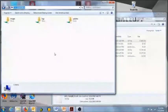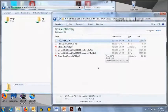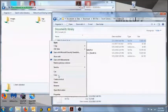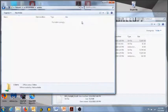If your BVS Smart Camera requires a firmware update, start by opening a file manager window and in the top address line type backslash backslash followed by the same name that was located after the HTTP login, containing the name of the camera. Once that's been typed in and you hit enter, you should see the camera's folders come up. Within these folders, you will notice a folder called 'update'. Go to the file folder where you copied the firmware from the website, and using the copy command, copy that file over to the update folder within the camera.